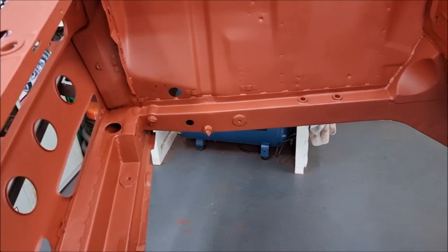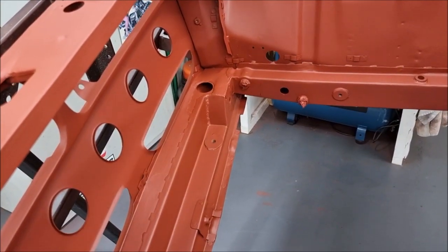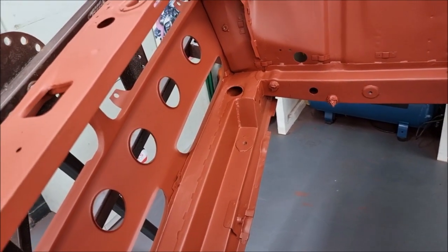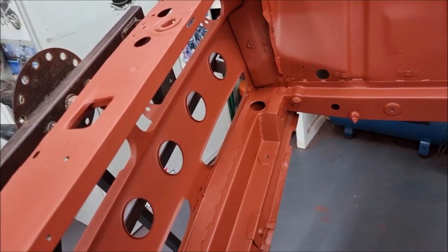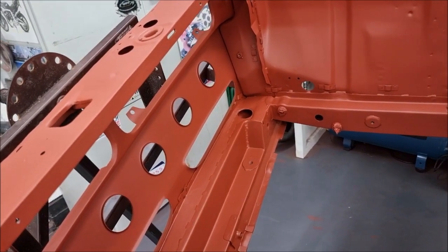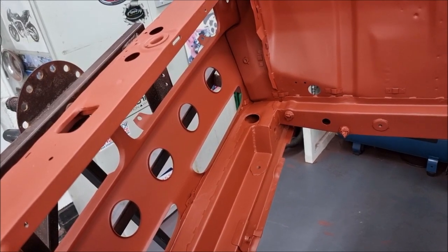Along the chassis rails, I've welded little fastener tabs which will carry the wiring harness on simple cable ties. I'm not a fan of drilling through the panels to put P-clips or whatever. I want as few holes in the panels as possible. So I welded on tabs.